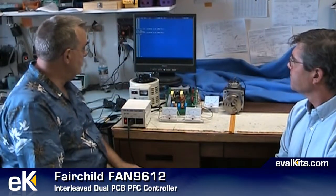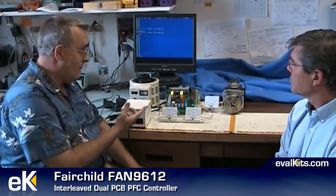Easy to set up, easy to make changes — pretty much all the parameters of frequency, voltage, soft start, and current limiting are our own setup. On your output stage, you can have a 48-volt motor or 50-volt, or 24-volt programmable output. We'd like to end up with a programmable 24 to 48 volt output, which just doesn't exist on the market today. We'd like 24 volts for stronger and slower speed running when the amperage needs to be higher, and then 48 volts allows very high speed and very high torque, flattening out the torque curve and extending the operating range of the motor from roughly 5,000–6,000 steps per second to 8,000–9,000 steps per second.